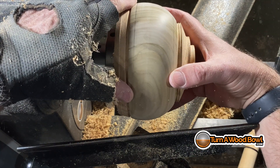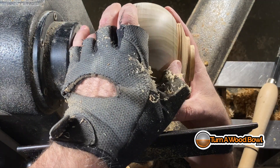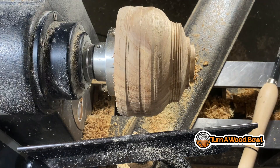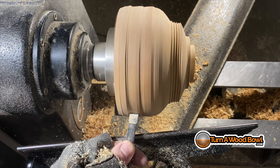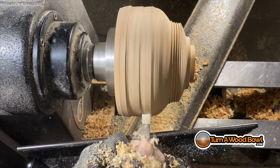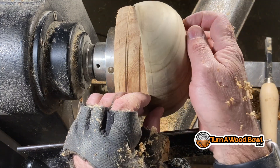There's a lot of eyeballing involved and you really need to take your time — check out what's fitting, what's not fitting, where it's contacting, and what can be removed so it fits properly. You really want to line it up and make sure everything is turning well. I'm just using the carbide scraper here to remove a little bit of material, whittling away a bit at a time until we get a proper fit.